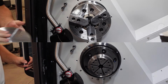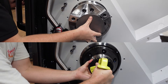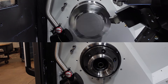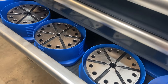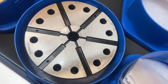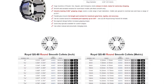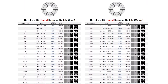Here's both chucks — one is a three-jaw and one is a collet chuck system from Royal. We love the Royal collet system. The only real downside is that these collets are very expensive. One of the things we wanted to figure out from the get-go is how are we going to hold many different diameters without breaking the bank, because these are like five or six hundred dollars each. They have a very limited range — this half-inch one can pretty much only hold half inch. They are a great company with very high quality products and different sizes and shapes, very cool system.